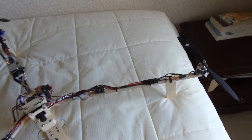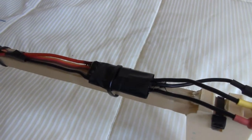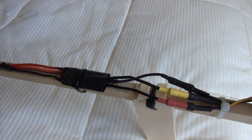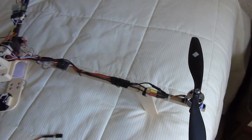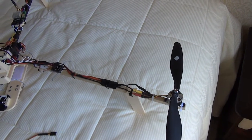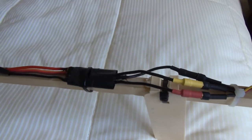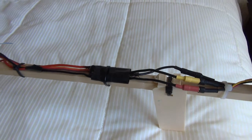Because of that failure I had no spare parts, so this time I've waterproofed all the ESCs. I've had to take the heat sink off, which I'm a little worried about for heat dissipation. I'm hoping that because they're exposed to the elements the heat dissipation will still be okay. This is more of a cruising machine rather than one that rips, so I'm hoping these things aren't going to overheat. They do have liquid tape on them all now to protect them from the elements.